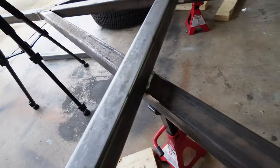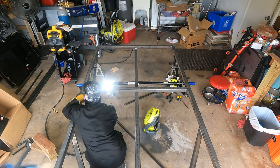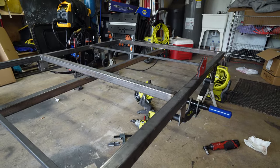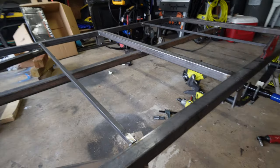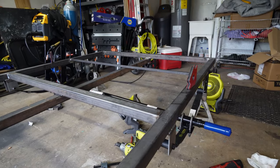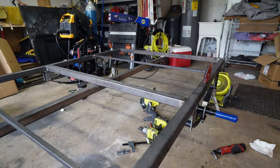I went ahead and welded everything up on all our joints from the top side for extra security. You'll notice we did not weld the top here — these seams are actually pretty close, but I decided I wanted to wait until I mount my walls and floor. I don't want to have to work on an uneven floor because of weld, so we didn't weld the top of these crossbars so that when we put our walls and floor in, everything should be flat and flush.